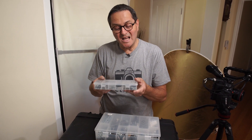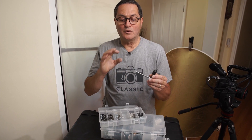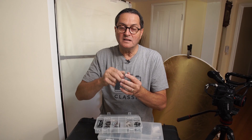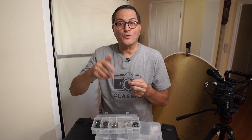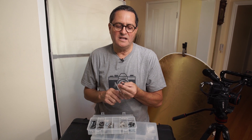This second one I have used a ton. This is a tap and die set so I can thread things and make quarter-twenty. If I cut one of the bolts off and it's a little ragged on the end, I simply set this up with this little device and I can re-thread it — clean the threads up on the end so it'll work. I can cut things to different lengths. If I've got a metal device or even a rig, I can drill my own hole, use this to thread it, and now I've got a quarter-twenty I can use. I just had a problem on my Sony a7R II where I threaded it wrong and messed up all the threads in the bottom. I took this out and re-threaded the quarter-twenty on the bottom of the a7R II. It's not perfect, but it got me on the rig and through the shoot. This is emergency stuff — so you don't get stuck without being able to resolve a problem and get on with your shoot.